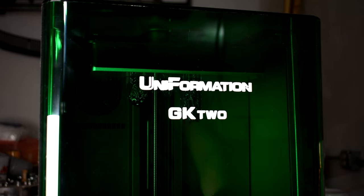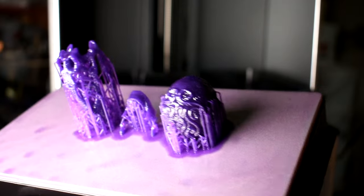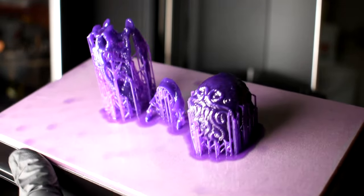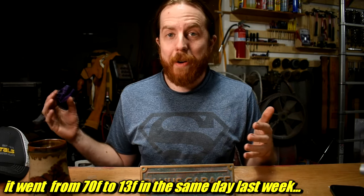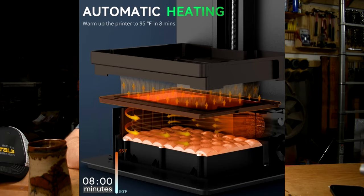To make it easier, I used a Uniformation GK2 printer. I've mentioned it before — it's my favorite resin printer, hands down. I've tried this on a few different printers, and the GK2 is the most reliable. I think it's because of the resin vat heater. This resin is really, really sensitive, and resins in general don't print very well if it gets cold. This is especially a problem here because this is Wisconsin — the temperature fluctuates like crazy and we're out in a really drafty garage. The GK2 heats the resin before it starts to the same point, and that reduces failures. I've only ever had one print in this resin on the GK2 that didn't come out fine.